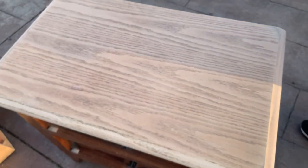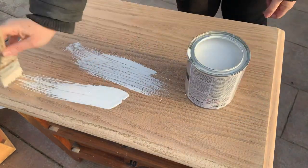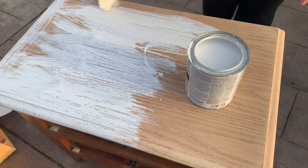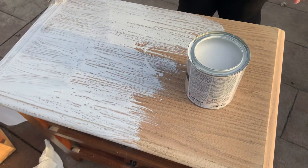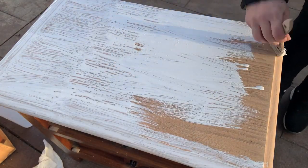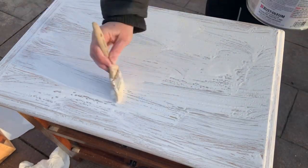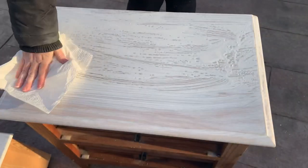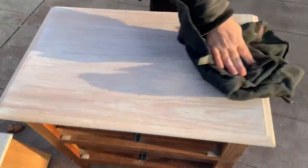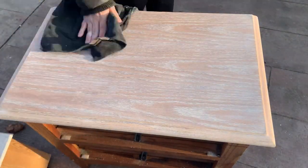Here I'm using Varathane's wood stain in antique white. I'm using this stain because I'm trying to figure out how to lock in tannins without bleaching my wood. I don't want to seal it with wax because I'm selling my stuff, and I don't expect my customer to re-wax their furniture a year from now, so I think a stain might work really well. It's almost like a pickled or liming color — we're just trying to lighten it up. I go with a paper towel to wipe the excess stain, but that wasn't working, so I got my lint-free cloth and that seemed to work the best, and I'm loving this look.